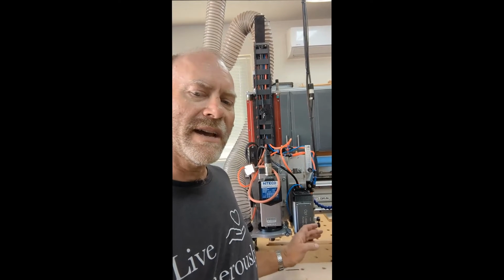Just going to do a quick experiment today to show what the XT8 laser can do across several different wood species with some deeper etching. Typically with the 15 watt laser that I had, or even my XT50 that's 6 watts, I would do fonts and different letters that were maybe a millimeter deep or so. But with this laser, you can really go. I've done some now that are 5 or 6 millimeters deep, really deep, like you would do with a spindle, only you get the nice crisp corners that come with the laser.